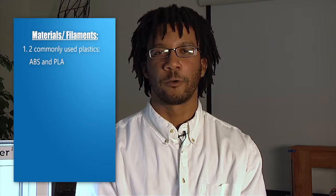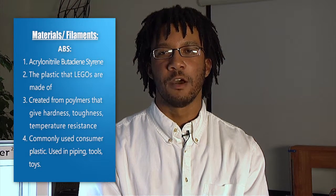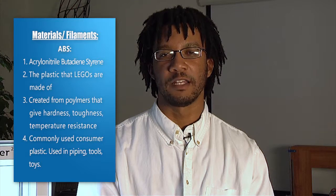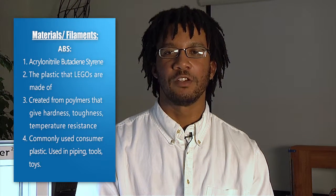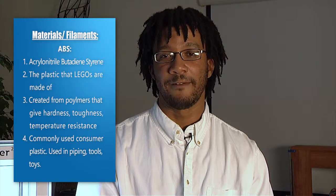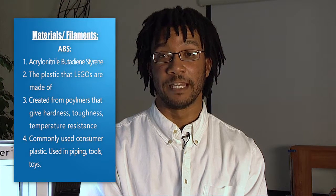Let's now talk about materials used with 3D printing. The most common plastics used are ABS and PLA. ABS stands for acrylonitrile butadiene styrene, which is a commonly used consumer plastic, formulated from various polymers that give it hardness, toughness, and temperature resistance. We use ABS for piping, tools, and even toys. In fact, ABS is the plastic that Legos are made out of. Anyone who has ever stepped on a Lego barefoot can speak to the toughness of ABS.